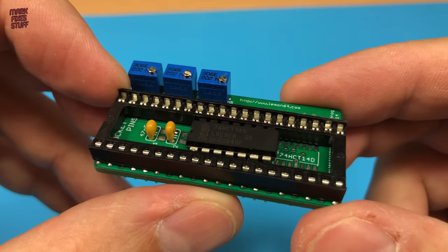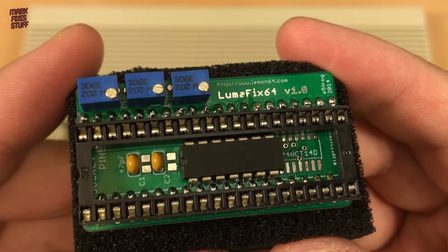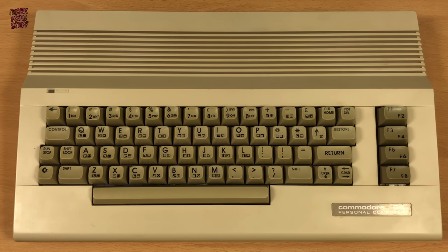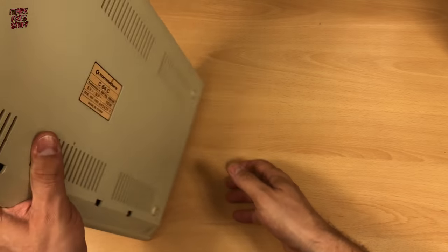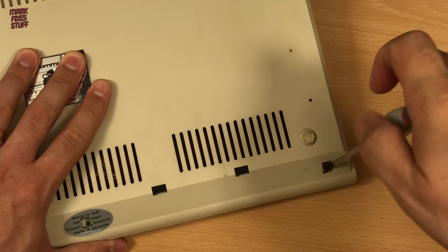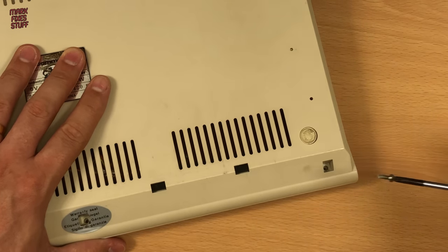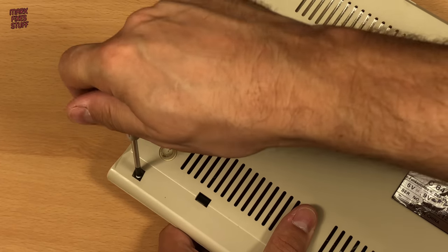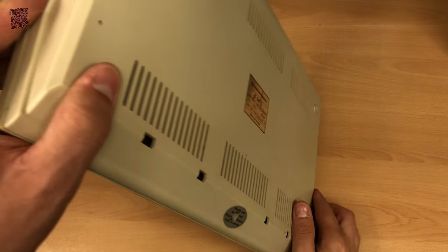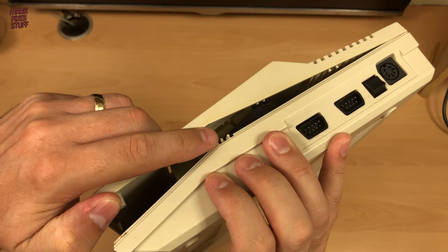That wonky chip fits. It's the next day, the sun is shining, the birds are singing, and all is right with the world. What could possibly go wrong? We have a screw missing from this machine, it being one of the later revisions that has three screws at the front and the rest of the case held with clips. If you push down on the lower part of the case, you can open this model without breaking those clips.